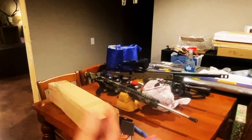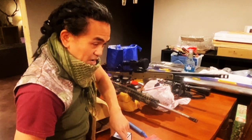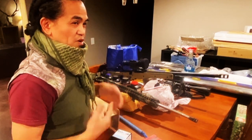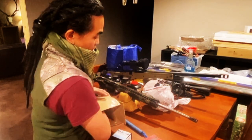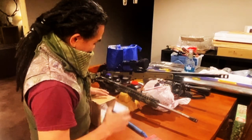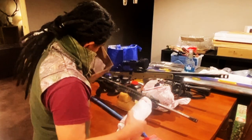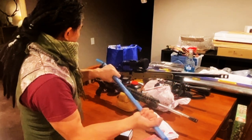My goal is to get this thing close to 3,000 FPS, because he was using roughly a 100 grain round nose bullet, which had no ballistic coefficient at all and the aerodynamics were horrible. This is an improvement on the aerodynamics. Here's the barrel — this is a .25 GPC that has a 1:9 twist.